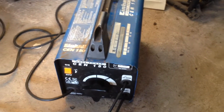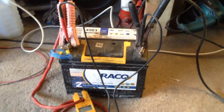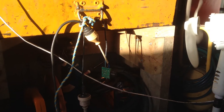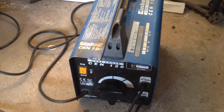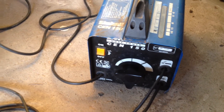That's the crude battery charger — an old stick welder with a bridge in it to convert AC to DC. Outputs go directly to the battery. I've got a little AC controller in an awesome box with an awesome cooling fan, and it's working well. Little controller: $4. Bridge: $30. That's $40 total for a potentially 150 amp battery charger.